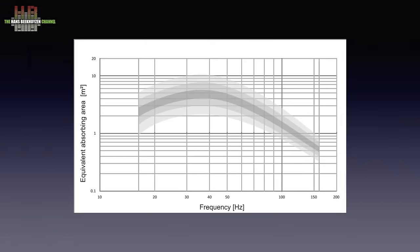The principle of this bass trap is simple. A microphone measures the air pressure variations between 15 and 160 Hz in front of the AVA. When room resonances appear in that spectrum, the two 14 cm drivers in the AVA move in a way that these pressure increments are reduced, like if the wall locally moves backwards. Although this sounds like a simple technique, it is quite a feat and two Swiss universities have been directly or indirectly involved.